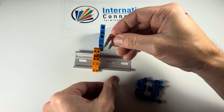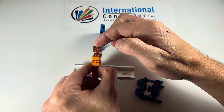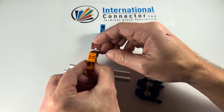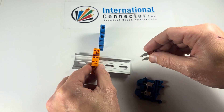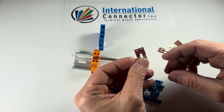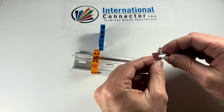If I were to try the wrong jumper, it's not going to work because the pin doesn't fit in there, and it's made for a block that has a wider center-to-center spacing. Every once in a while people end up sending these back. You can always reach out to me — Clayton at intconnector.com — and I can help you make sure you get the right parts.